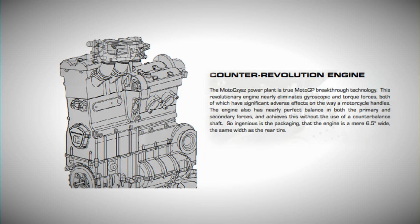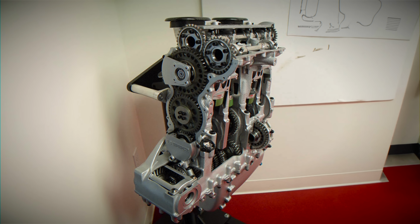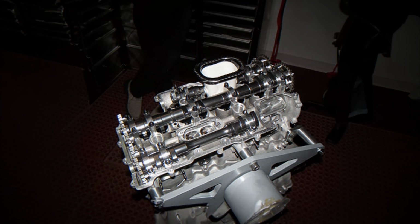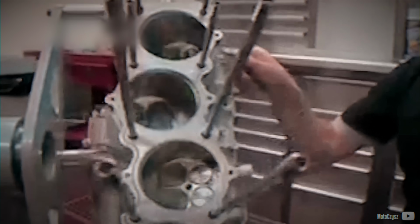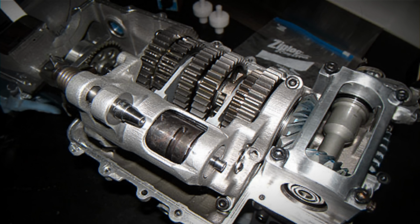Initially, the crankshafts were offset vertically, necessitating a complex quad-cam head setup. Subsequent versions aligned the crankshafts horizontally, simplifying the cylinder head with a 3-cam configuration, 1 central intake unit and 2 outer exhaust camshafts. The block and head formed a single unit, with sealing beneath the bottom dead center, making the valves the last components to be removed in the engine overhaul. Gearbox was mounted beneath the crankcase.